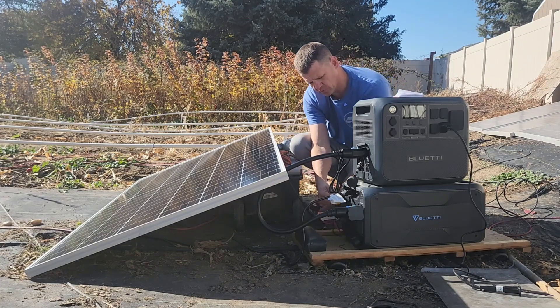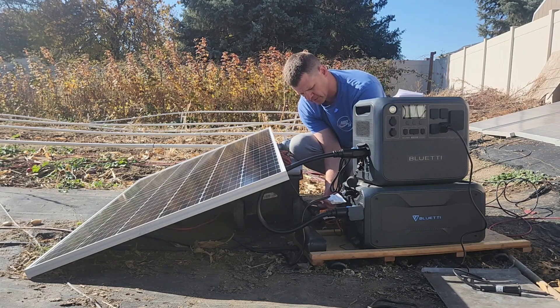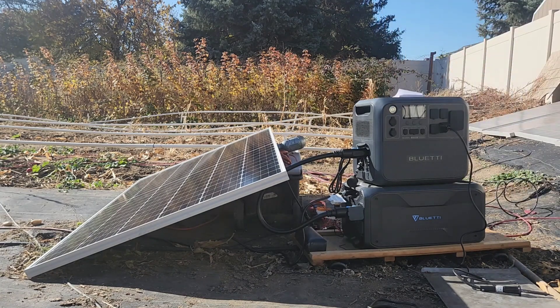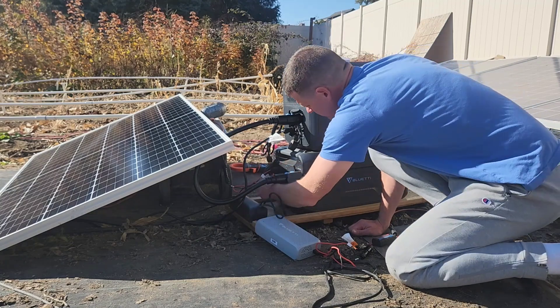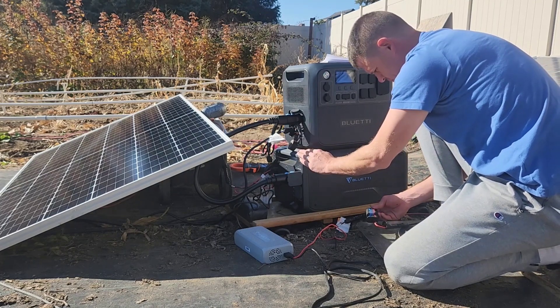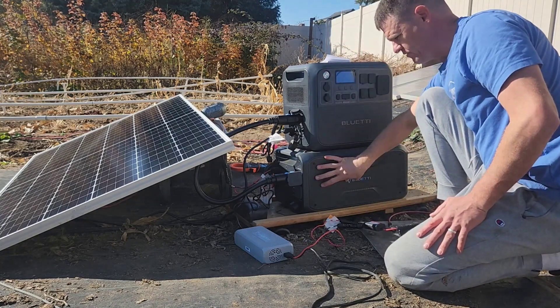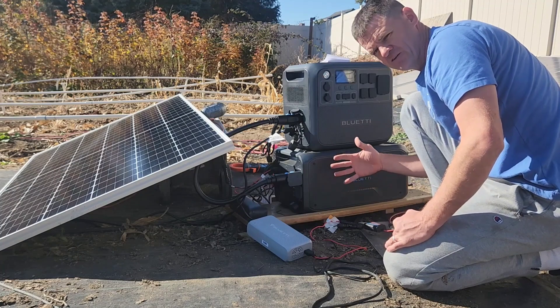The solar panel is actually producing 230W but this port reduces it to 200W. You can exceed the 10A rating and it shouldn't damage anything, but exceeding 60V open circuit will likely damage the unit. With the DC charging enhancer connected to the AC charging port, I added two used panels in parallel giving another 300W, so about 1,100W charging the bottom battery total. If you get an extra battery and the DC-to-DC optimizer, you could hook up three strings of panels to this system.